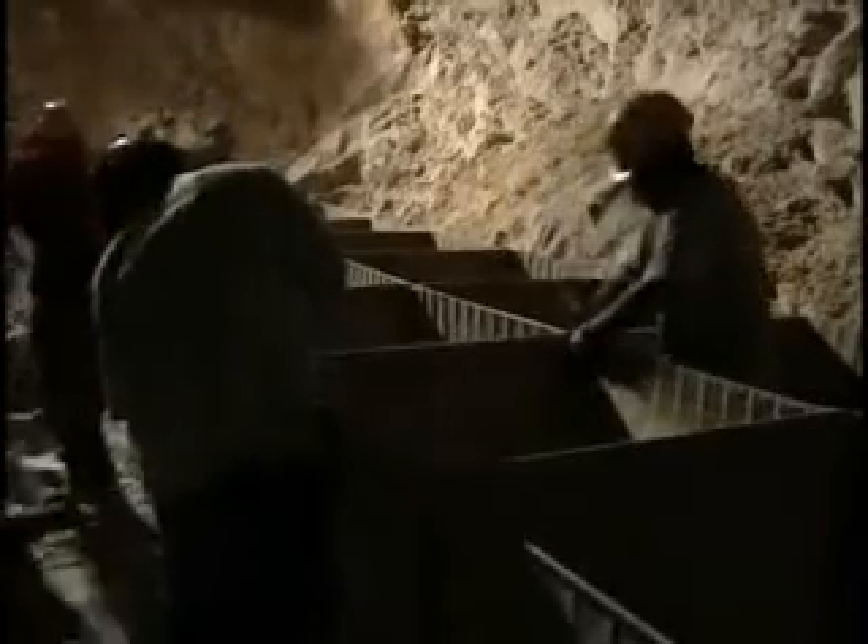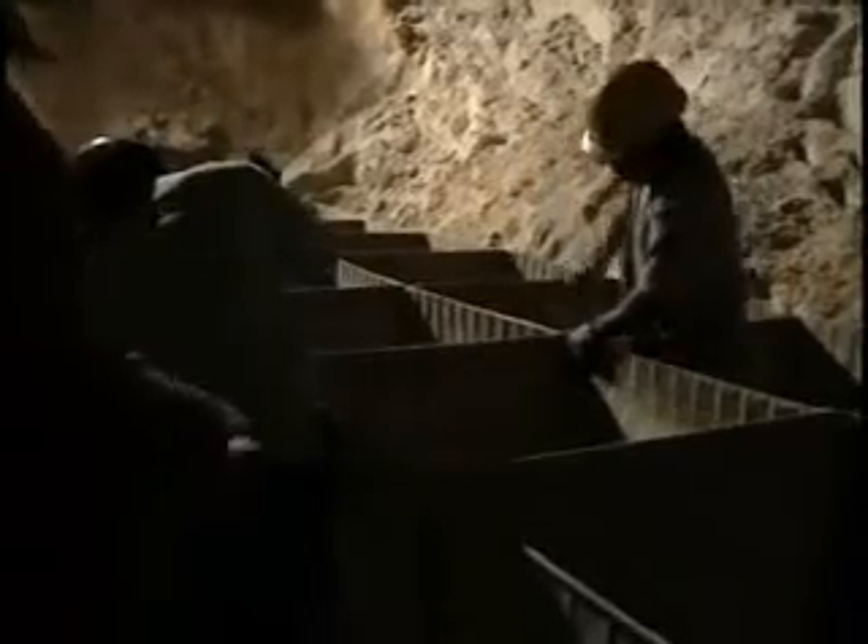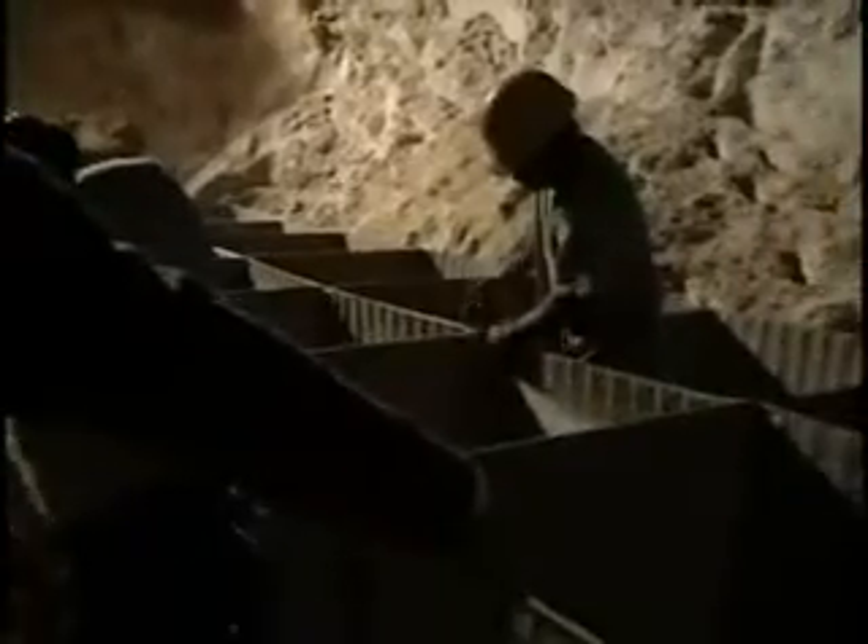Therefore, it's not going to want to sink. The fabric flaps are approximately six inches in length. They are laid down flat on the bottom surface, and sand is then placed on top just to hold them in place temporarily until all fill material can be entered. Right here you can see him interlocking the two coils, and then he's going to drop a rod through connecting them.